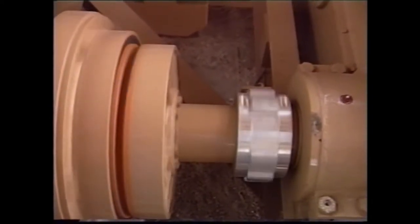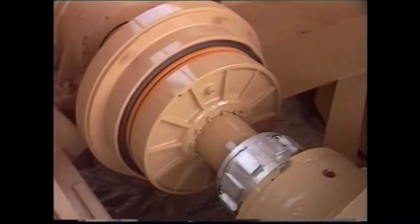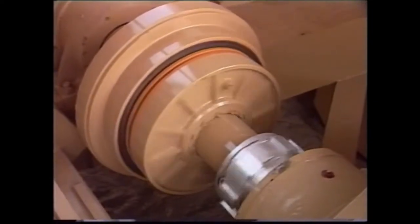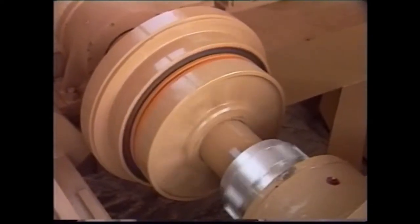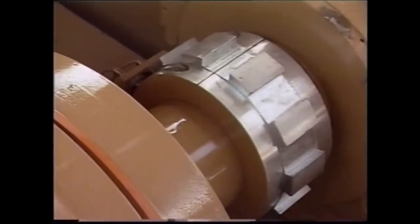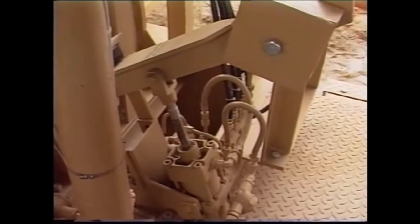The cam ring serves to measure the speed of the winch and the drag bucket's distance. The whole plant is pneumatically controlled. All actions are connected in parallel, that is, when the in-haul drum is engaged, the out-haul drum is automatically braked. When the out-haul drum pulls, the in-haul drum is braked in turn. This prevents the cables from hanging slack and avoids unnecessary wear and tear. When the counterweight of the brake cylinder falls, the winch brakes are applied.